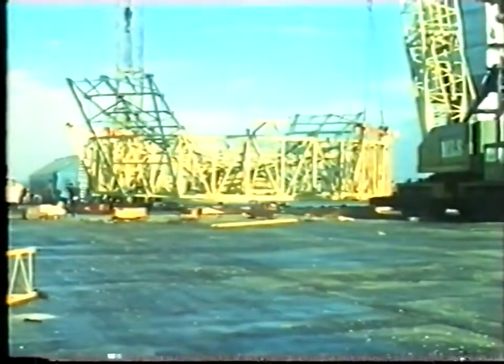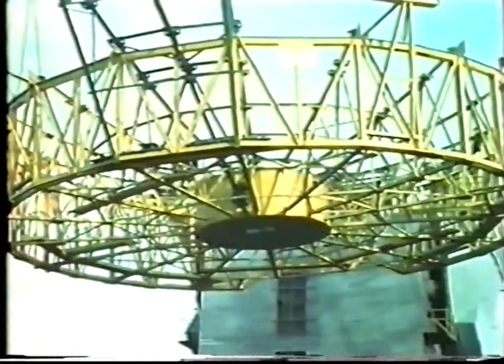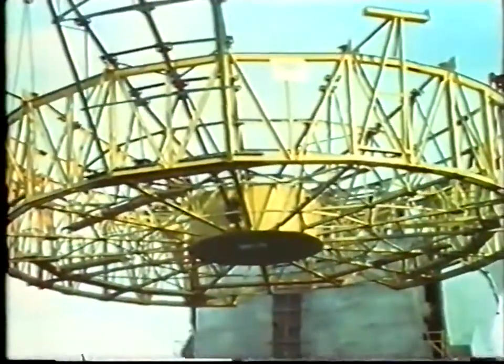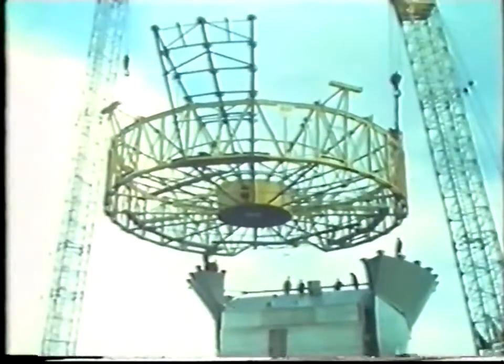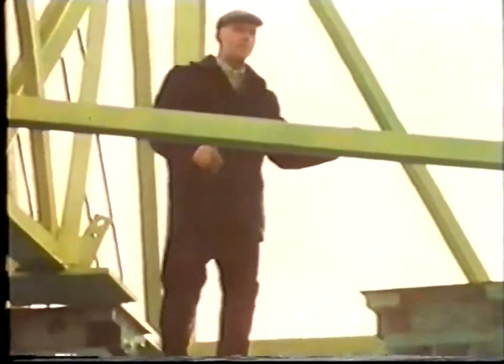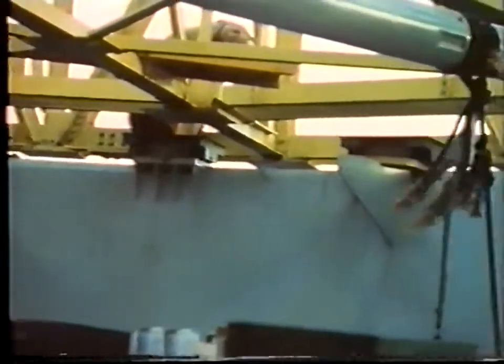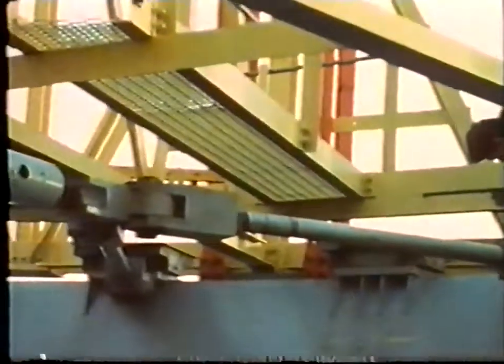Part of the backing structure is assembled on the ground ready for lifting. The object is to set the feet of the sliding joints and then to insert the fitted bolts. All the bolts went in without undue assistance from a hammer. In order to avoid the use of shims, the backing structure was bedded down and placed on top of each sliding joint.